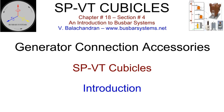Generator connection accessories. Surge protection voltage transformer cubicles. Introduction. Surge protection voltage transformer cubicles are single-phase units, one for each phase, each comprising voltage transformers up to a maximum of 4 per phase, a surge capacitor, and a surge arrestor, with or without surge counter.